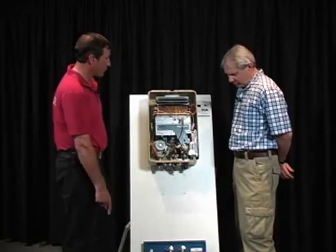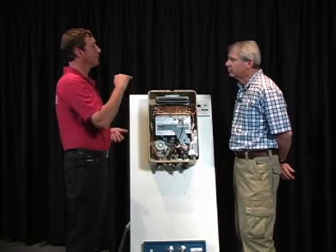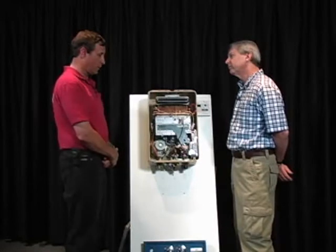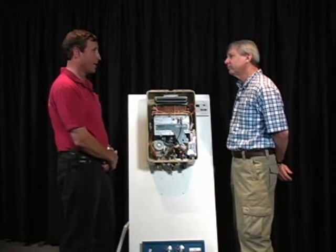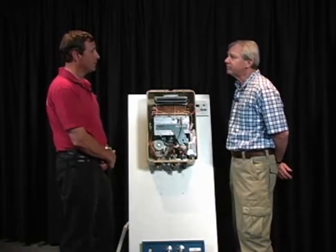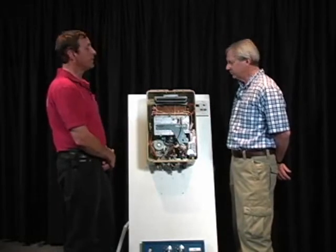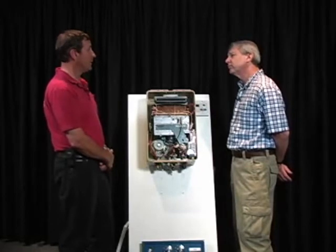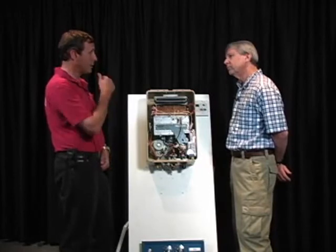But where we've got to come out through a rim joist, we run into situations where the rim joist is not 12 inches off the ground, and you see the vent pipe coming out. We know it's too low. You can just look at it and tell. If it's less than 12 inches above the ground, snow's going to cover that thing up, and when it does, it's going to cause problems for the venting. Typically, a Rinnai, for example, is 1 foot from an opening door or window or any kind of intake. Power intake, it's 4 feet. It can't be right directly below a deck. You can't be right next to a door.